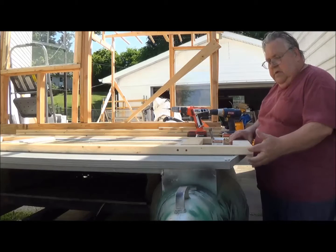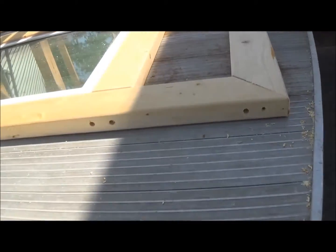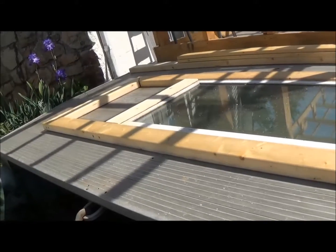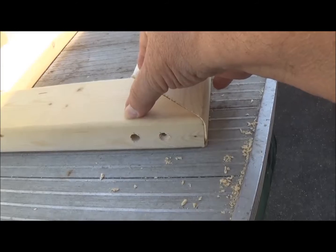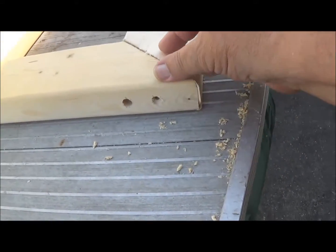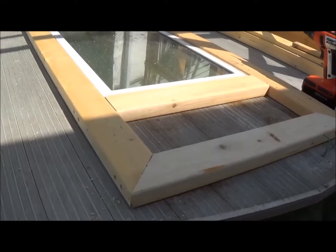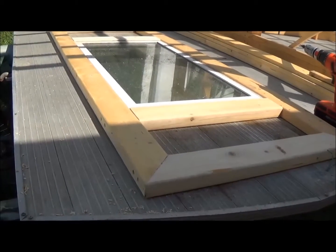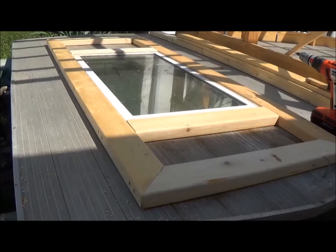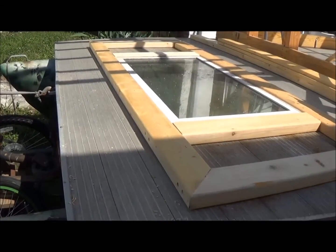But you get the idea — do the same thing on the ends, a couple of screws. This one I can go with three and a half, it'll hold, and I'm going to put some glue on it. Here you can see I've already pre-drilled all the holes — they're countersunk. Two here to hold the cross piece or support, and this is going to be the corner. I need four inch screws here; I only have up to three and a half. I need three and a half here and shorter ones elsewhere — I've got everything but the four inch, so I'll have to put this off for a while. There are many ways to put these together — with biscuits, pegs — but this is pretty simple and it'll work. The screws will make it plenty strong, I'll add some wood glue, and once I put paneling on it the thing will be rock solid. It's a small door — six feet by less than 30 inches — but it should do.